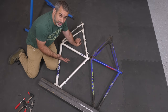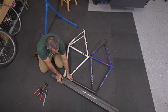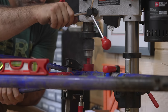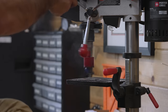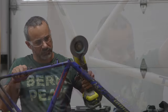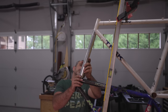There are lots of different ways we can build this, but the way I'm going to do it is run a chain down to the bottom bike, so this bottom bracket is going to have to be right over here. I'm going to extend the steerer tube like that. I'm as surprised as you are they fit together. Now I have to clean the paint off of the frames where they're going to get welded and line them up. This is where I can really screw up because if the angle is wrong, the bearings in the headset are not really going to be right.